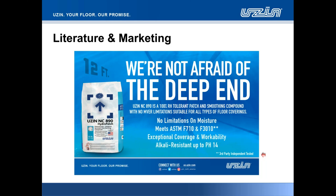For example, I've seen a marketing point claiming that just not falling apart in water is enough to be moisture resistant. Well, we sat down and thought a little bit deeper, and our project became to develop a moisture resistant compound that would ensure that moisture will not have any detrimental effect on the patch over the long term. That means that any property we are able to test as it relates to a patch must withstand prolonged moisture exposure. And what are those properties that we test? For example, compressive strength: does it retain it? Does it gain it in water, in high moisture, and in air? How about bond strength? Does it retain bond strength?